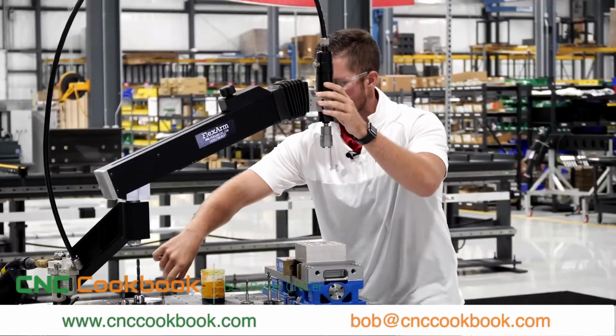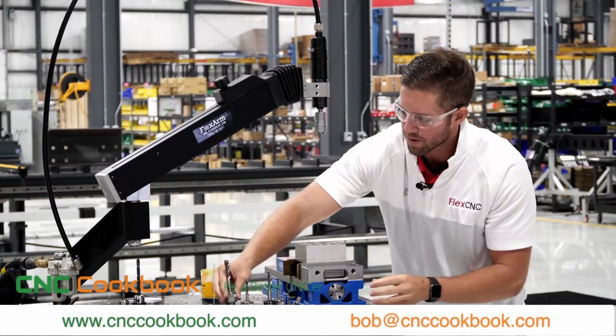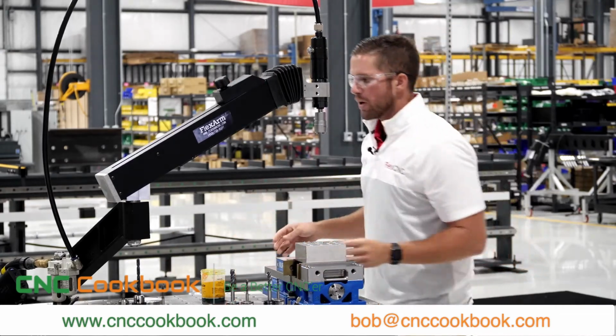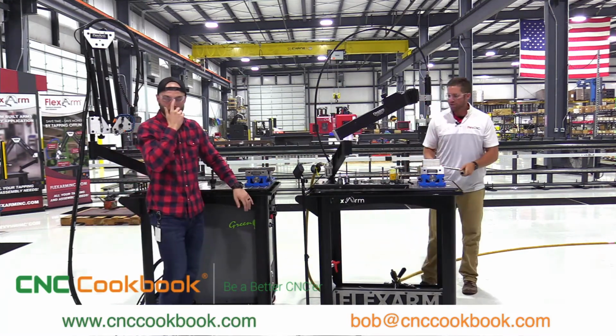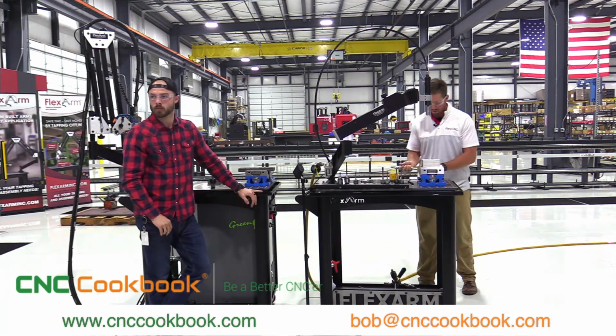No, very good. Obviously, it plowed through that. So what's the next size that we're going to be working with today, TA? Yeah, we're going to go ahead and switch out from the aluminum block. We're going to be tapping some 1/4-20s in some 304 stainless steel.